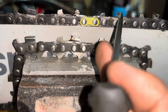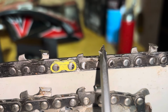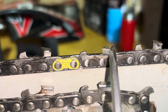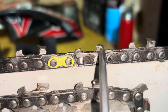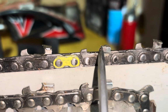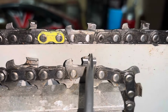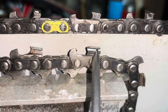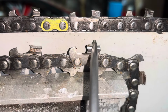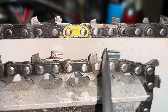As you can see up here, these have a much sharper cutter head. That comes right to a sharp 90-degree angle with a 90-degree corner in it. This provides an actual cutting point, whereas down here, this is semi-chisel, which only has part of a chisel, leading to a rounded over edge, leading to much less of a pronounced point.